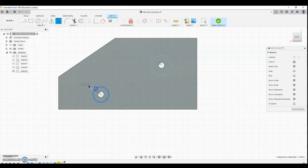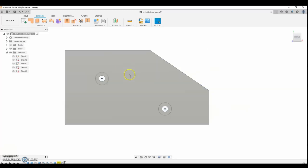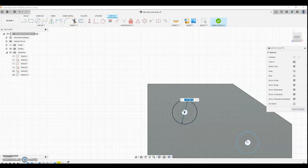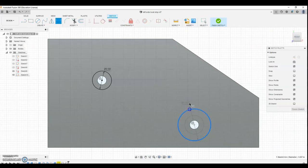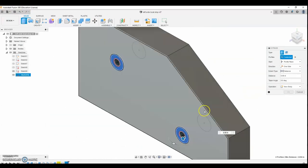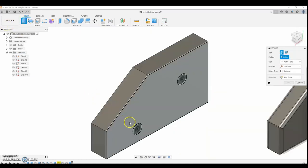Let's dimension these quickly — the counterbore diameter is 0.9. These are the left and right sides; instead of making two different models, the outside profiles are the same. I created the base block and just flip it for whichever way I need for the holes. On this side I'll put the same circles — 0.9 — and extrude those down a negative 0.3.